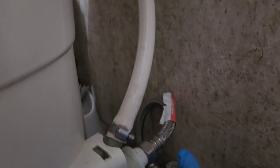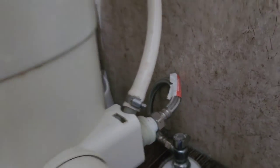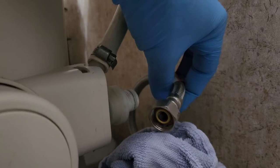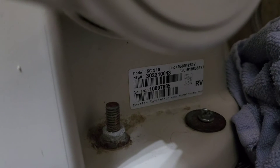You're going to want to disconnect your water, make sure your valve is off, and then also disconnect this hose. So we've got our hose and water off. I do recommend just grabbing a rag so you don't get water all over the place. Next, you're going to take these anchor bolts off right over here — you also have one on this side, which I already removed. Once you take those off, the toilet should pop right off.